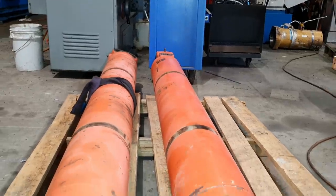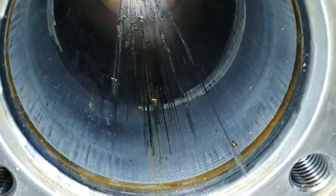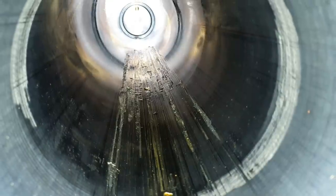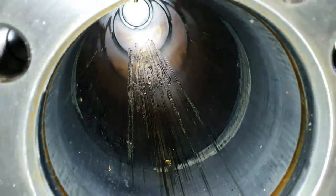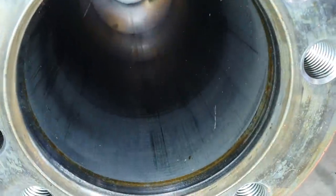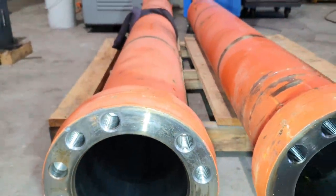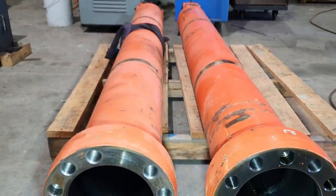What we've got here today, we've got the left and the right barrel, and we've also got the left and right piston. The left barrel seems to be in worse shape than the right hand side. It seems there's been a foreign material of some nature make its way into the cylinder, and because the cylinders share oil, it has gone through both of them. We're not exactly sure where this foreign material has come from. We can't pinpoint what it was, so the customer's going to have to strip all the hydraulic system off the machine, pumps, hoses, pipework, tank, the lot, and try and clean out as much as they can,